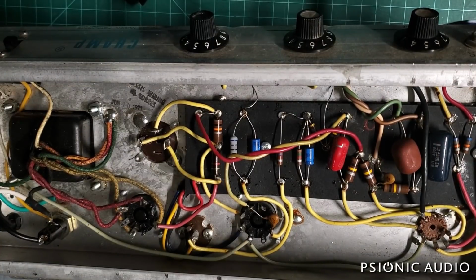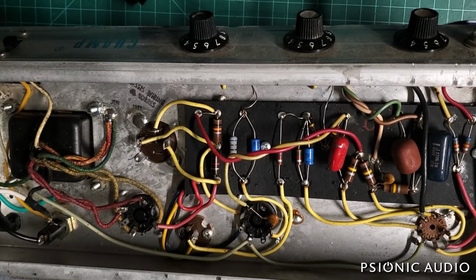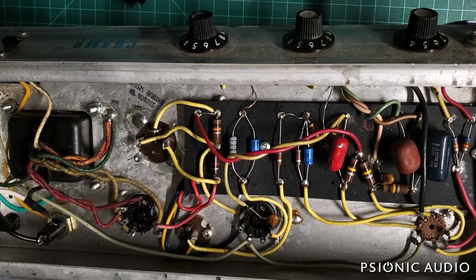That said, the reason these things tend to be really boxy is, in my opinion, Fender crippled these in comparison to the Princeton, so that this wouldn't sound anywhere as good as a Princeton. They put in a 15K fixed mids resistor versus the 6.8K in the Deluxe Reverb and many other Fender amps of that era. That 15K is a little over twice the value of the original and most other larger Fenders. And it's actually 30% more than you find on a Twin, which has the same tone stack with its mid pots maxed out.